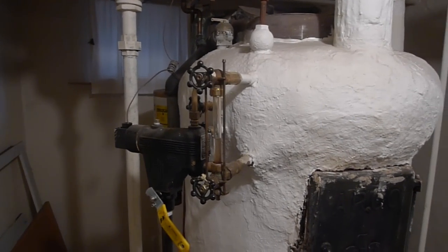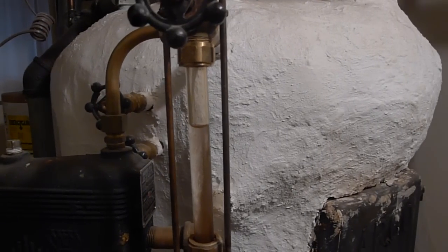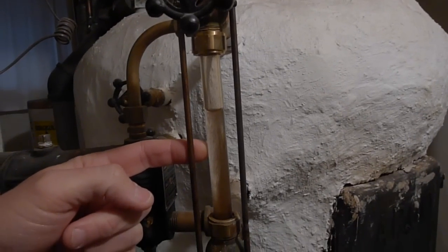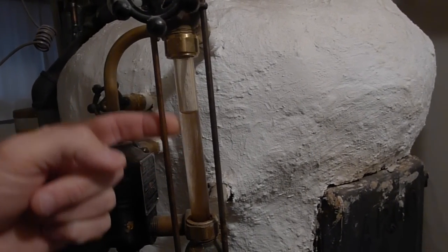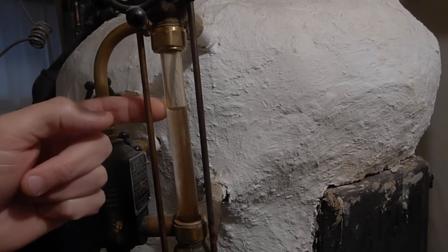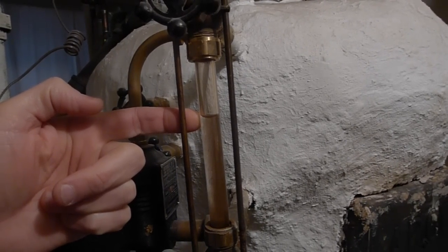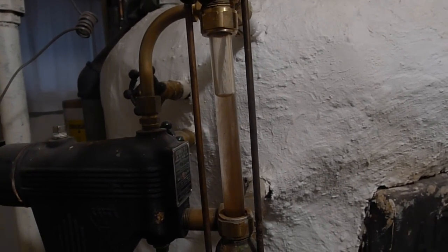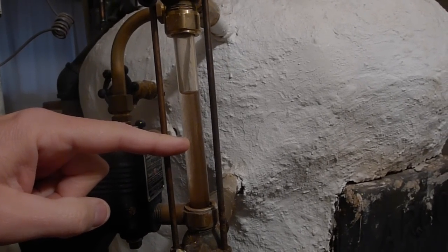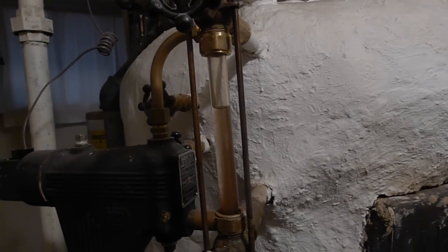A couple of things I learned since the last video: the water level in the boiler — I think previously I said it should be below half, but my buddy said it needed to be above the half. So all this winter I've been doing it at a higher level and it's been a lot better. It's not going to over-stress or overheat your components if the water gets low. Previously I had it down too low, which he said was way too low. So I've been keeping it just a little above half.